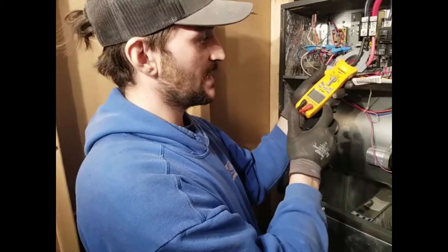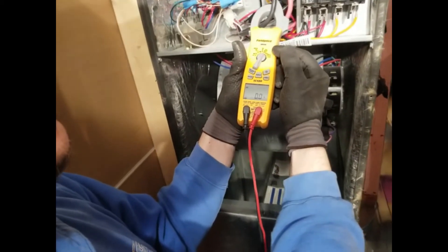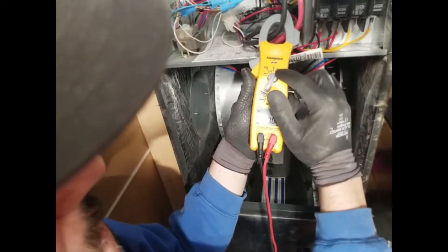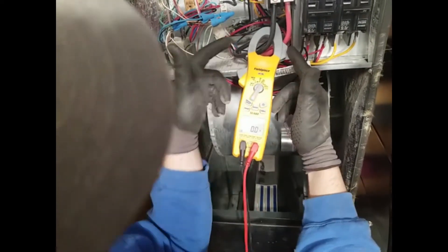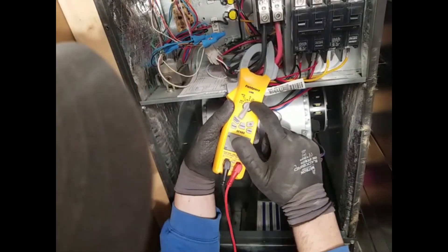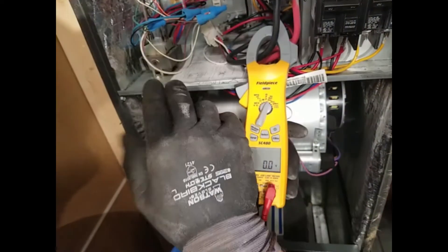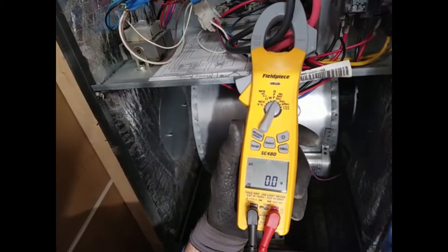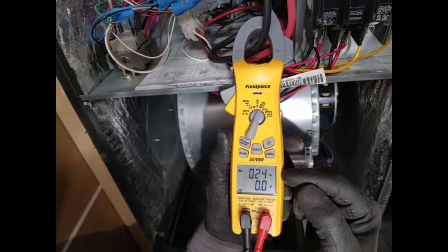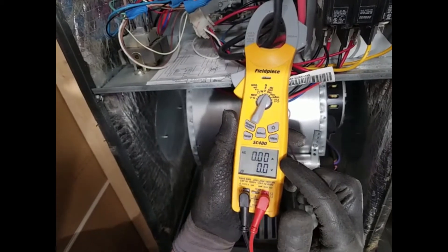You need a multimeter. In a house, the current is alternating, so to test the furnace you have to go to amps, using the clamp — that's the big A, AC for house. Each element is 20 amps. By putting back the power and setting my meter to amps, we'll see how many elements are working.